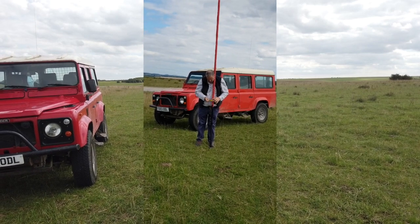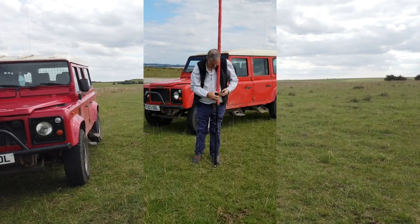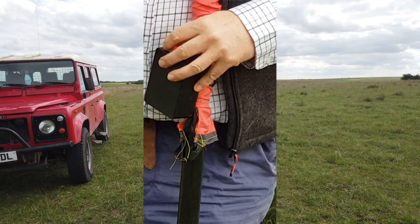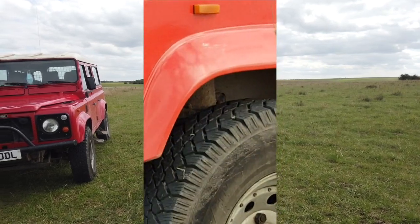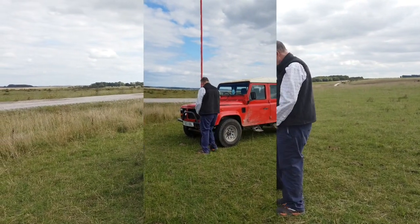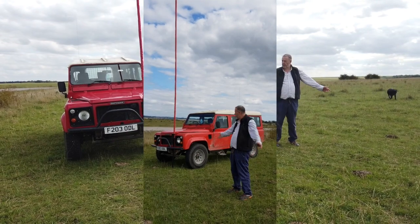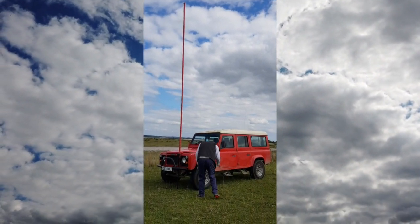Get your un-un. Using the velcro tape, fasten it to your mast. Get the feed wire, put it into the bind post, hook up your coax and work the world. That antenna is now ready to go: 100 watts, top band to 10 metres, no radials, no wires, absolutely nothing more than you see there. And that's a full all-mode HF antenna.